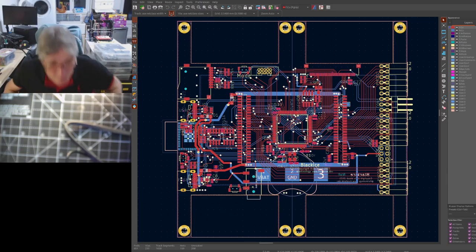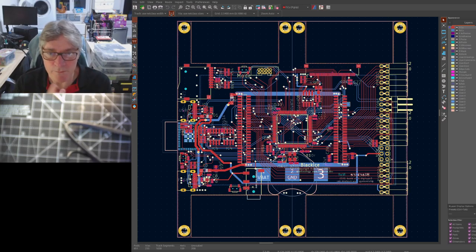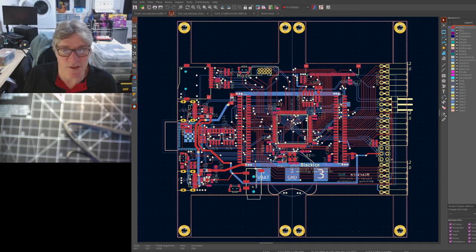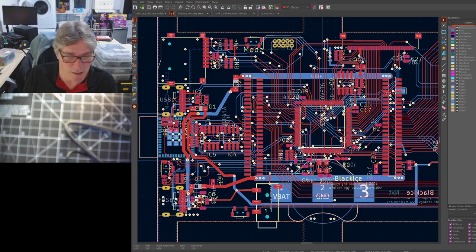On this version of BlackIce Next, when you order the BlackIce, you've got the midplane, which is the ICE logic bus, with the tiles attached underneath, and then on top you've got the controller board, which is the BlackIce board. You've already seen the Hyperbus version, which has Hyperbus flash and RAM. The other option is this, which has not Hyperbus but Quad SPI, QSPI, flash and RAM. Similar quantity, but half the flash in fact, and slightly lower cost. But also, because we've got pins left over, we only use half the number of pins to do QSPI versus Hyperflash.